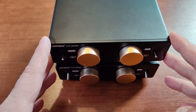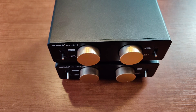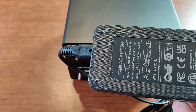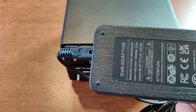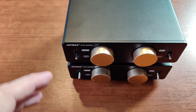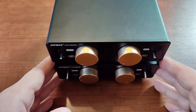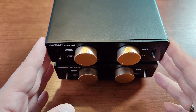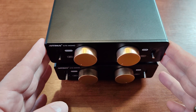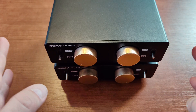They are currently being sold with new GAN power supplies. These are supposed to be outputting 48 volts with 5 amps, so 240 watts each. The specification says it's a maximum 300 watts per channel amplifier, but the power supply is 240W, so it will never reach 300 watts. The efficiency of Class D amplifiers like this is in the 90% range.